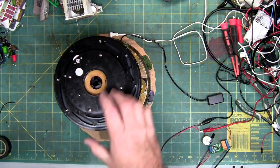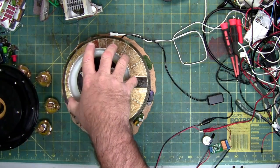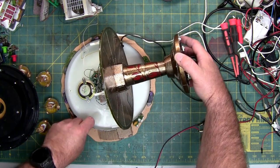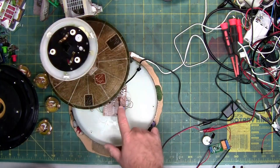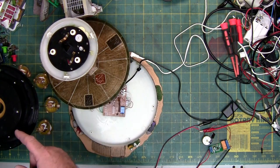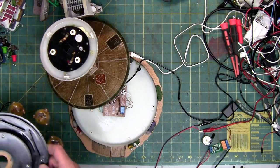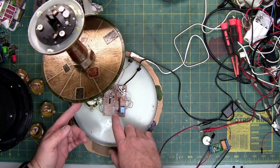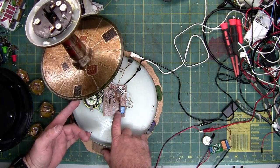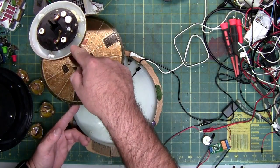Here's the swinging arms — there's the rat's nest inside. The yellow and white wires that are hanging are the lights that go up to the top. This blue relay right here is the reversing and forward relay — it's not getting any power. So that's why we get no swing motion, no power to the rotor fingers, and no power to the rotor up here, which makes this little motor do its job. There's also no power going to the sound chip right there. This blob chip got fried.